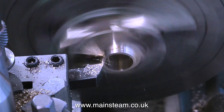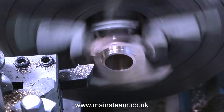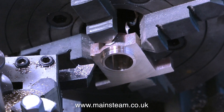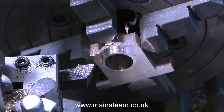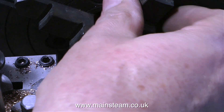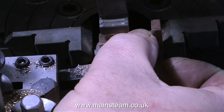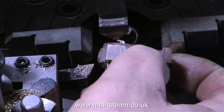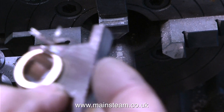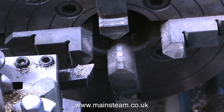My original plan was to do this with both of the bearing blocks — that is, machine one side, bore the hole down the centre. Then the original plan was to mount both of the half-finished blocks on a piece of 5/8ths bar using some Loctite 603, with the machine surfaces facing each other. Then all I would have to do is put the piece of 5/8ths bar in a three-jaw chuck and machine the other side, turn the bar round and machine the other side, and then the bearing would be complete — apart from the threaded holes to take the bolts that hold the top caps in place. And the piece of 5/8ths bar would remain in the bearing blocks until the whole job was finished. But that's not to be.